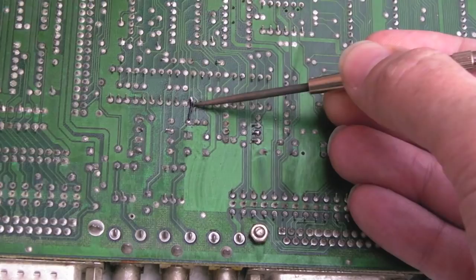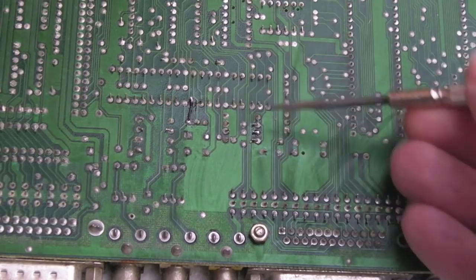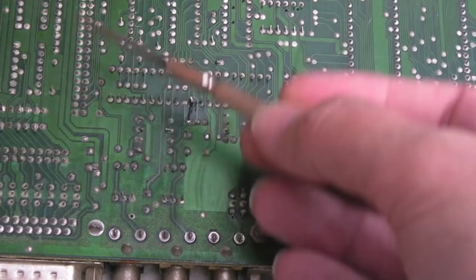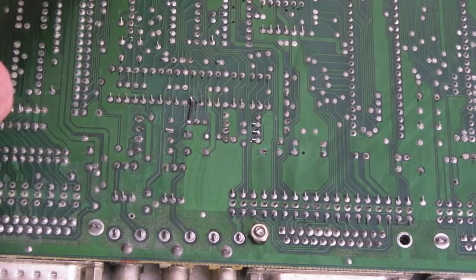The trace is barely hanging on — you could stick a bit of solder over it to join it, but it would be flimsy. The pins here are in a right state — I've reflowed a couple, and I need to inspect this super closely and reflow any others that look questionable. There are so many connections affected around here. Even one of the connections on the power connector looks suspicious. In total I've probably resoldered about four or five points around this back area.